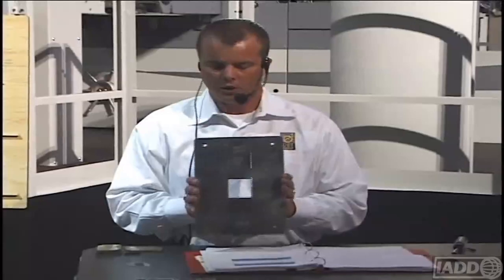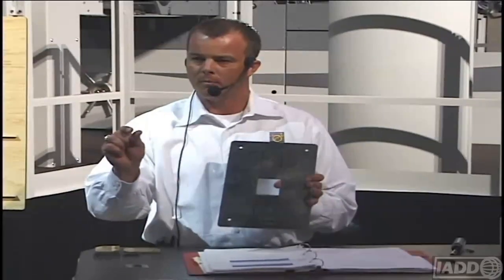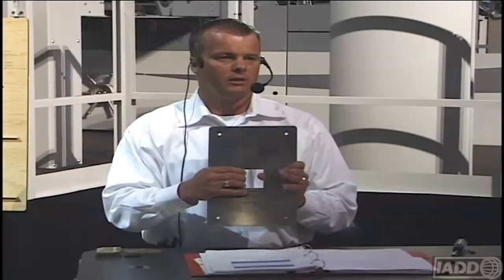Whereas on the steel score plates, the steel is much stronger and lasts longer. Therefore, you can minimize that support wall because of the properties of the steel, and you can emboss in an inline application much tighter to your scoring rules.